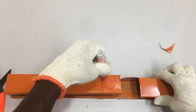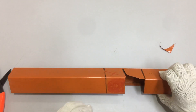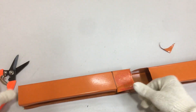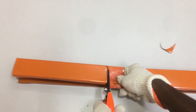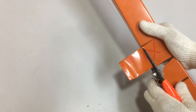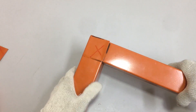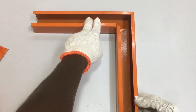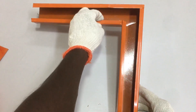The next step is to mark the spot on the side of the trunking to cut — but there is no need to cut at the back of the trunking marked X. Cut at the 35 cm line first, then bend outwards the trunking fragment, then cut the 35 cm line fully. Pull out the cut trunking fragment, then cut it out completely. Then bend the trunking inwards. Now you get a 90-degree side bend for the trunking. We are halfway to completing the side bend — all cutting looks good with no defect.